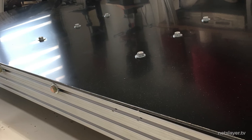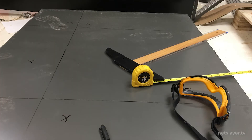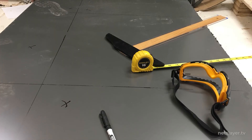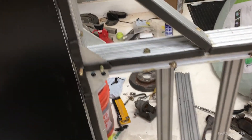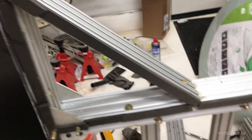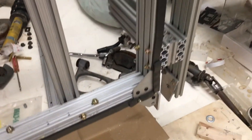You're probably wondering how easy it is to work with aluminum composite panels and how you actually cut them. I used the mark, score, and bend method - you use a marker and utility knife, then bend them back and forth until they break. This worked really well for big cuts. For something more intricate or to speed up the process, I put it through the bandsaw or used the Dremel Saw Max. Then I bolted the panels to the frame using 12 five-sixteenths bolts, and later I'll add the plexiglass to the opposite side.